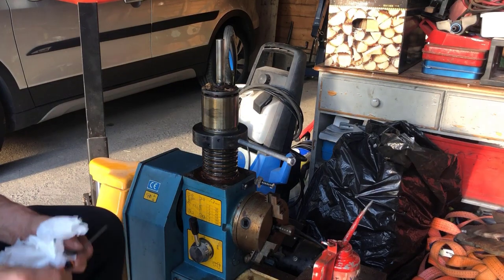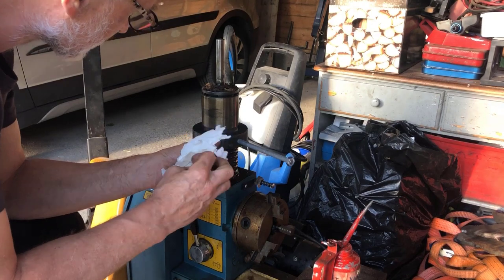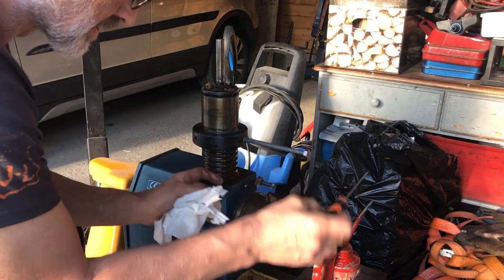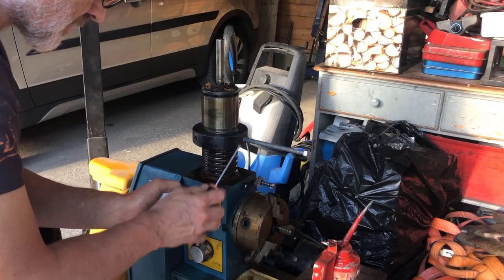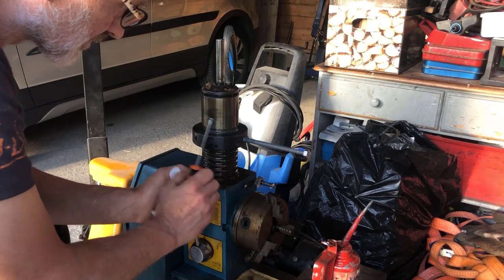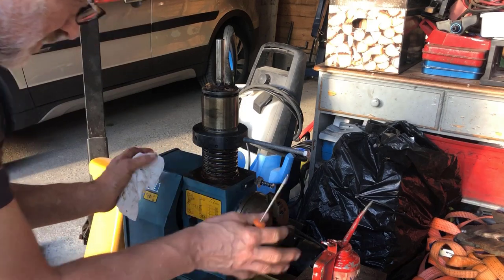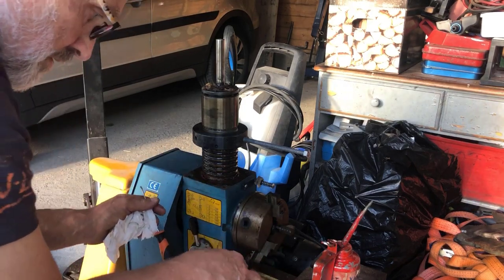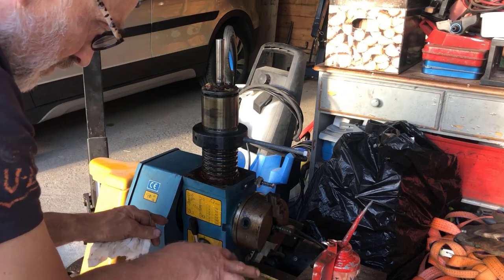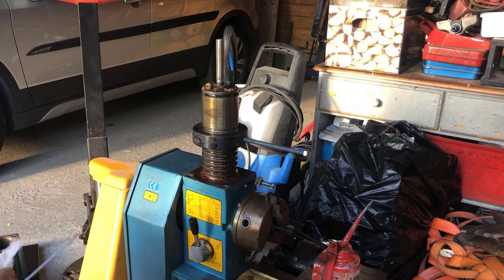I'm going to do a partial teardown anyway, or maybe a full, wanting to place the milling head a bit further over here. I'm not certain whether I will keep this or move the entire thing over. We'll see. But I want to disassemble everything to get it down so that I can move around things and then install the ELS. I don't think I'll repaint, I think it'll be like it is, but of course I'll get rid of all this rust prevention.